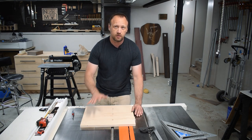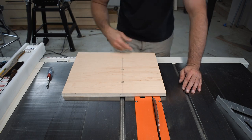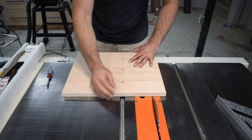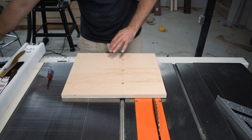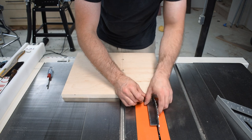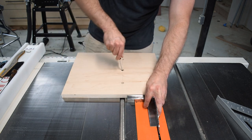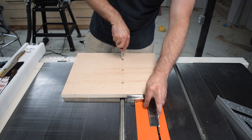Before working on this, I made sure my piece of plywood is perfectly square, which is a huge help for getting everything lined up. Ultimately we'll put a fence on the back side, and getting that fence at 90 degrees to a blade tilted at 45 degrees can be tricky. I raise my blade and register the back of the jig to it. I'm a little off, so I adjust the bolts in the miter bar until it's at 90 degrees.